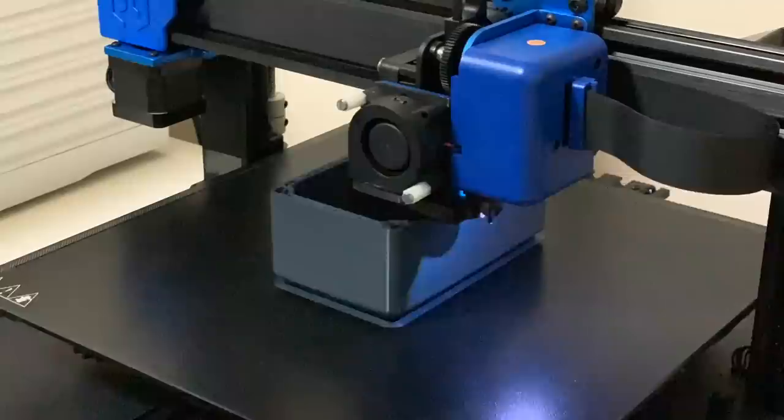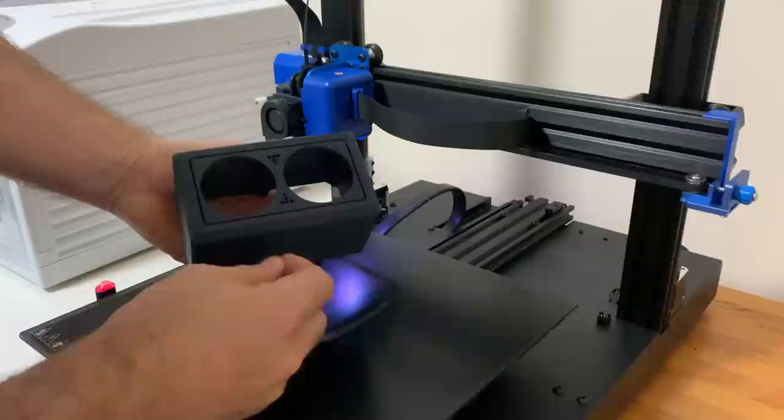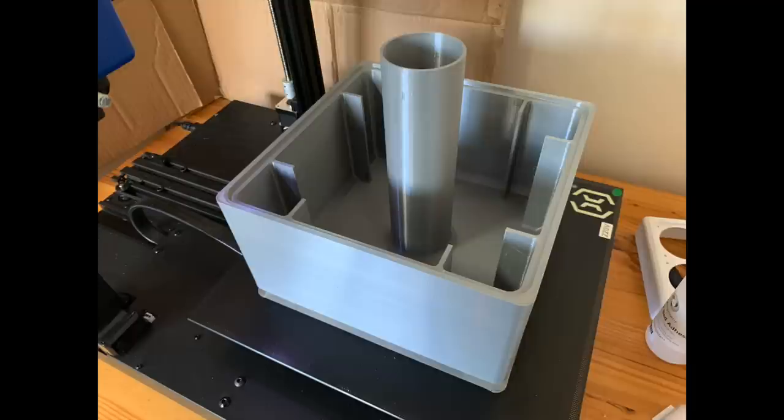The printing itself took a long while, with each part of the subwoofer enclosure taking about a day each, and the rest another couple of days of continuous printing. I used PLA, and this worked very well, giving me great prints on my Artillery Sidewinder X2 with a 0.6mm nozzle. I'm not publishing any of my print settings since this will depend on your printer and the type of PLA that you are using, so some experimentation will be necessary.